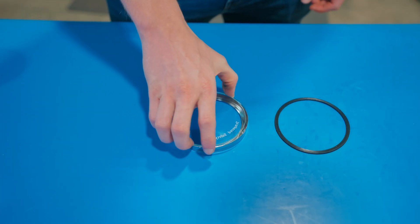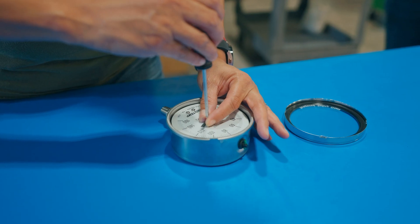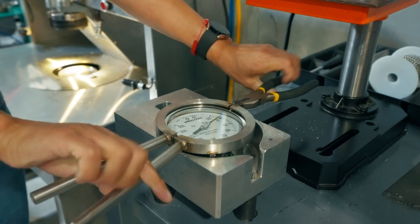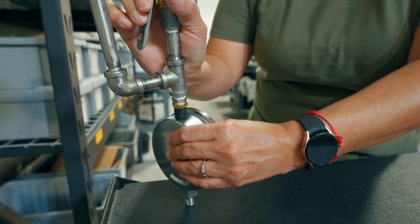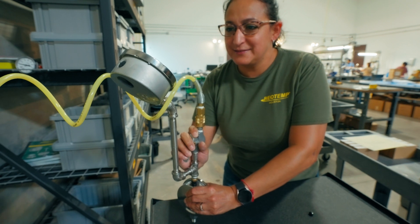Similar to the crimped ring, the lens, gasket, and bezel are assembled before being placed on the gauge front. The bezel is then twisted on. If field modifications are anticipated, the bayonet style gauges can be ordered with a hand-tightened bezel. After ring installation, both styles are case leak checked to ensure proper sealing on the gasket.